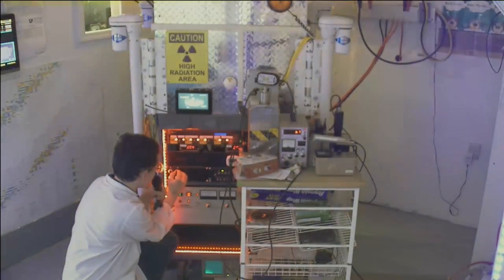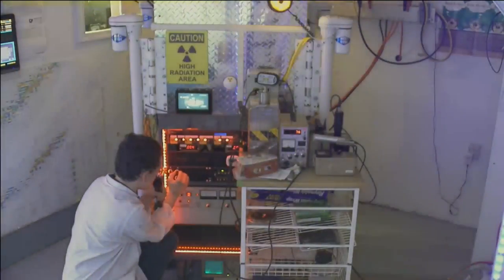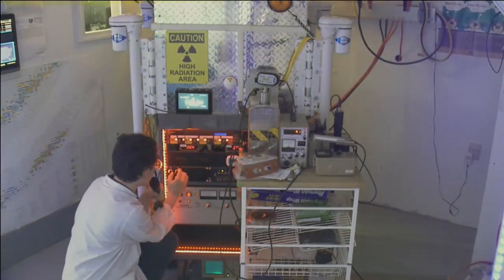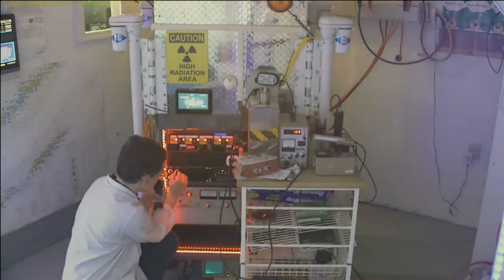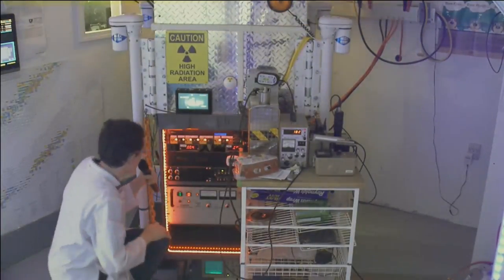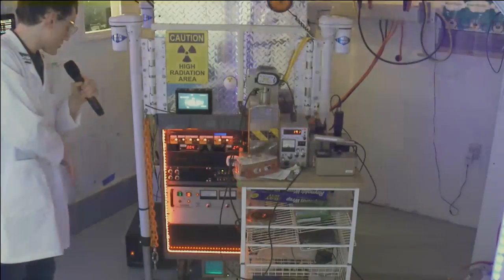Start to drop gas flow a little bit more. And hopefully get us balanced at 60,000 volts at 5 milliamps. Here we go, we got 1 cc of gas per minute, 4 microns chamber pressure, 5 milliamps at 60,000 volts.